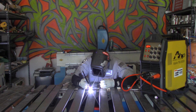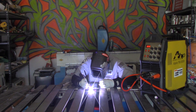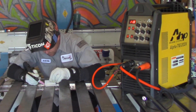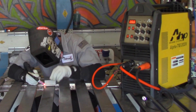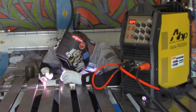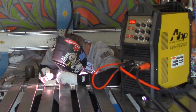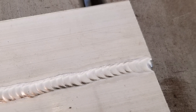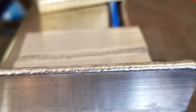Now switching over to aluminum — I am picky about aluminum. I weld a lot of it and it's my favorite metal to play with, aside from titanium. The analog knobs make it a little hard to refine precisely where I want it, but I have no legitimate gripe because once I laid down some beads and played with the coupons, the result was nice and smooth, easy to taper out, with good control. I did the butt weld, then a T-joint. There's even enough control to do little quick autogenous tacks. It's not a bad machine at all — it just straight up runs.